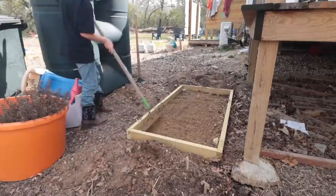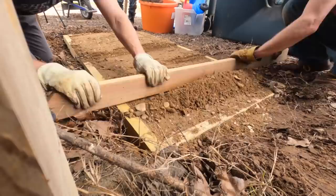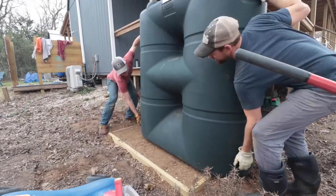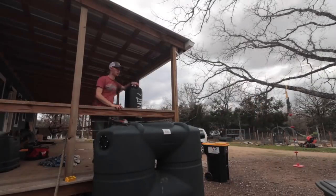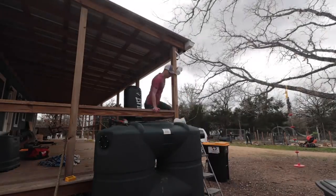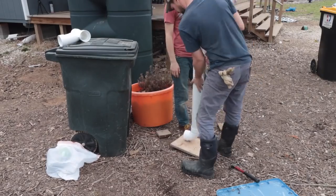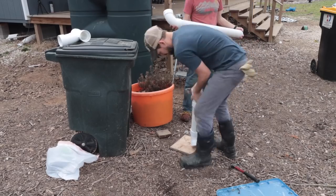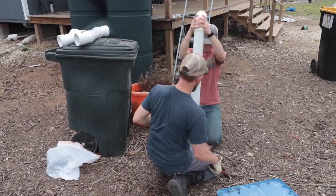We go through the same install concept, but simplify this time. A leveled base form made out of 2x4s and then fill it with gravel. These slimline tanks have a built-in filtration system, so no first flush is needed. Plus, this water is only ever going to be used for our garden. Since they are small, if we ever need to clean them, it would be a piece of cake. Remember, if you're planning on rainwater for your household use, definitely install a first flush on these.